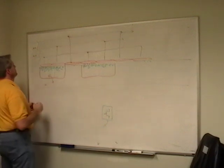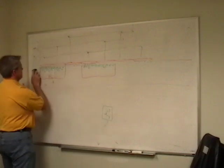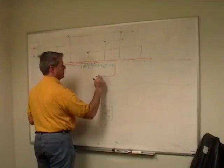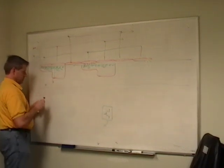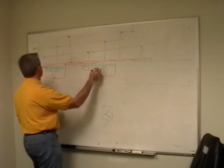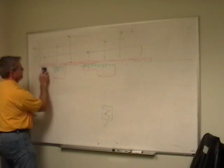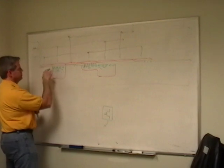And now let's slowly take this voltage away. And we see this well starts to look something like this. And so these electrons are getting squeezed, and so these electrons are going to run over here, some. And then we take this voltage away all the way and even make it negative. And we basically seal this up. And we've transferred all this charge from here to here.